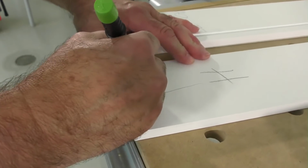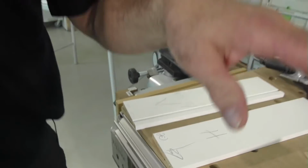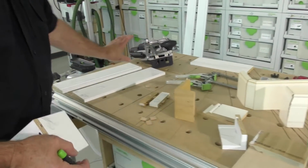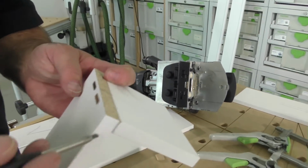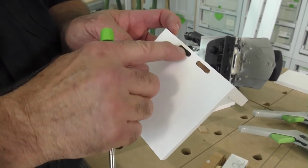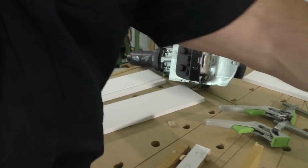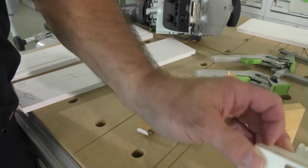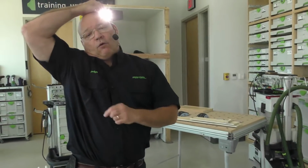I'm going to write here, and I'll explain in a minute, 20 and 37. And the reason for that is I actually have this visual for you here. If I use the flap on the machine here, look, see the flap, and reference the edge, from the bottom, and this is why I have 37, I'm going to place my 10 in here. But from the top, if I go 37, they're right here in the middle. I want a more pleasant looking, what? Spacing. Okay? So I did that. That's for the through tenon. I do the exact same thing for the 4mm.